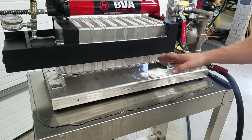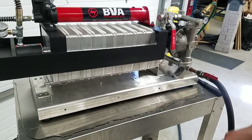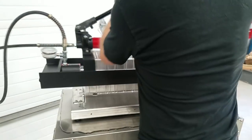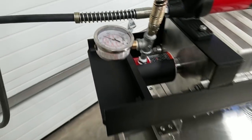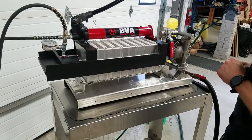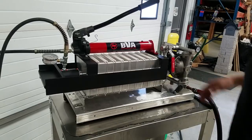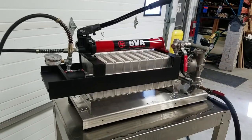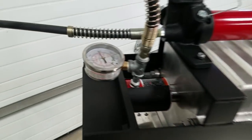Keeping in mind that every one of these PIGs comes with a drain tray on it, with a floor drain through it. And we are at max pressure — you're never going to see leakage worse than what we have right here. Now we are at about not quite 7,000 psi and the leakage has for the most part stopped. There's 8,000 psi — the pump isn't even cycling anymore. It's essentially completely mitigated.